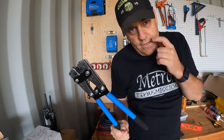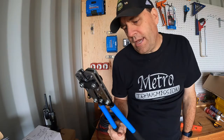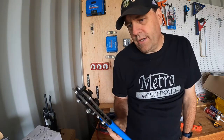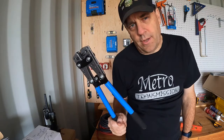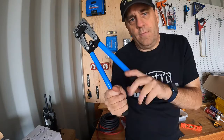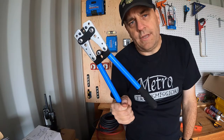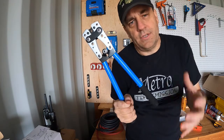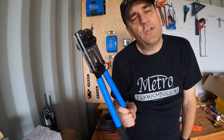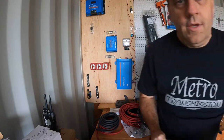This is the coolest thing ever — I have one of these at home and bought one for here too. If you're working on anything battery-related or DC power-related, you're going to be putting big copper lugs on things. This crimper does from eight gauge all the way up to like double-ought. It's a big crimper with long bars for good leverage. If you're doing a lot of DC wiring you definitely need one of these — using a small hand tool is hurting yourself for no reason. These aren't very much money; just snag one on Amazon or your favorite store.